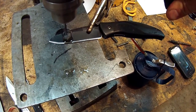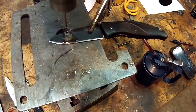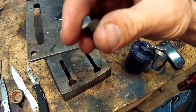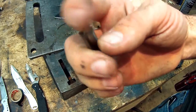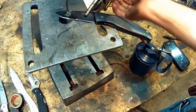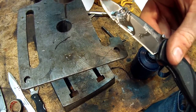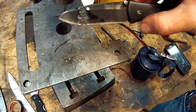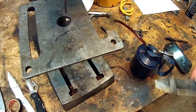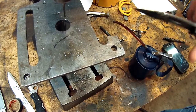They're actually solid carbide — not just a carbide tip — 100% full carbide all the way through, with a 140-degree split point edge. That's what sets these apart from any of the other ones. You can see we've got a hole all the way through right there. It's due to that 140-degree split point edge — that's what makes the difference. It's so sharp, it's not like a blunt masonry bit; you get a machine-style hole even on these great super steels. I drill hardened steels all the time, and these are pretty much the only thing that really work in a timely fashion.